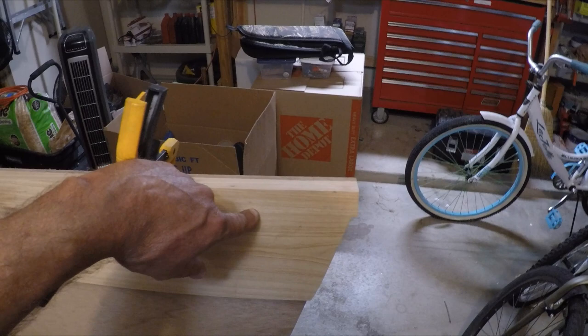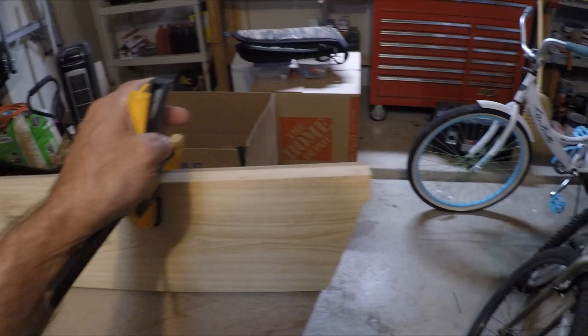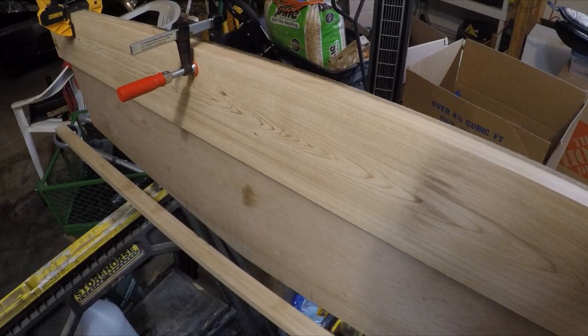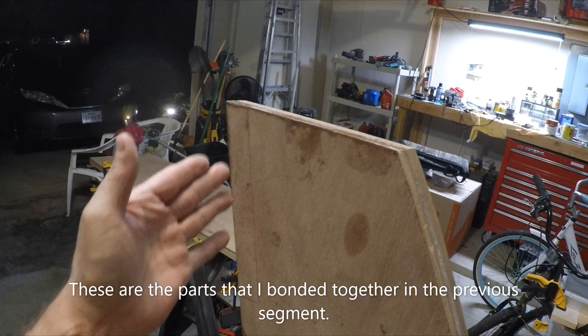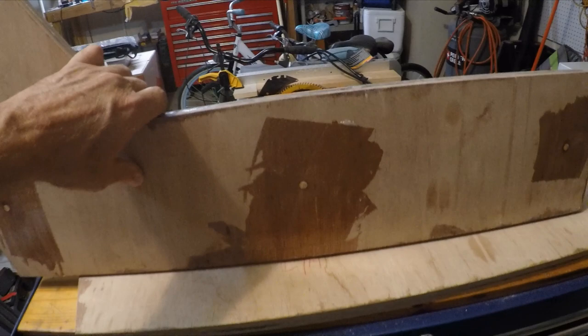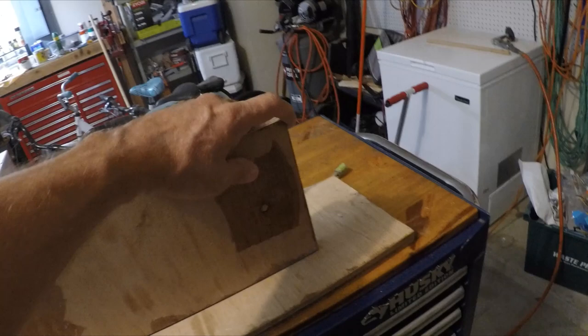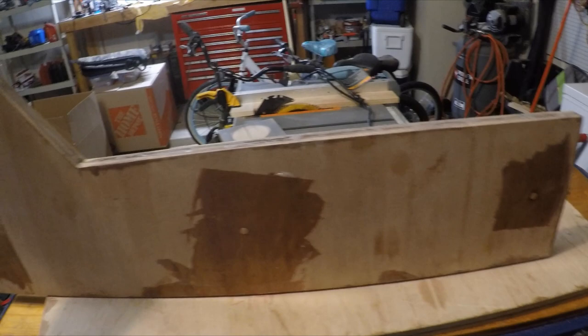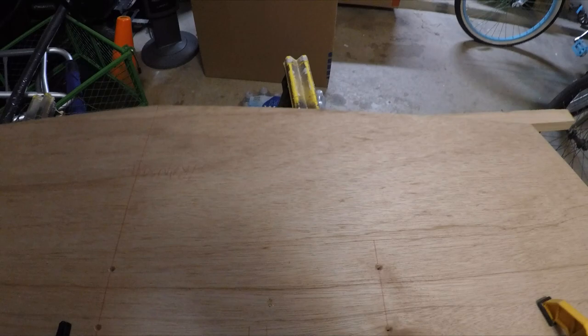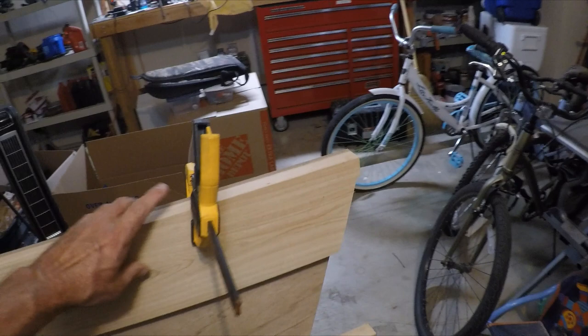You kind of have to think two or three steps ahead. I pretty well have these pieces here that I said I was going to attach to the middle — they're over here on my toolbox. These pieces are 14 inches apart like I mentioned. The transom's going to attach back here, and then we're going to attach to the frame. I'm glad I did not go ahead and epoxy this thing in, because when I got to looking at it I realized I did not have a way to attach the gunnels, and I've got additional cutting, shaping, and notching to do to this piece of one-inch cypress.